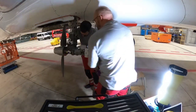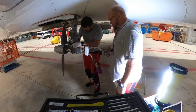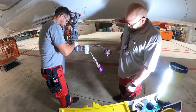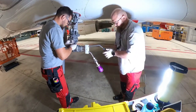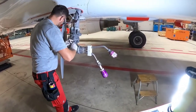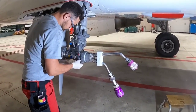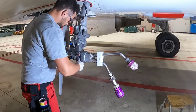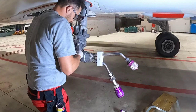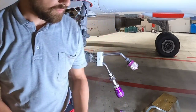Now, what's the purpose of the RAT? In an emergency, the hydraulic pump of the RAT supplies the blue hydraulic system. Electrical power can also be supplied through the blue auxiliary system by the constant speed motor generator. The really interesting fact is that the system supplies hydraulic power in less than 4.5 seconds from the time it gets the electrical command to extend. The automatic function only operates when the speed of the aircraft is more than 100 knots. Hydraulic power available from the RAT is sufficient to supply flight controls and the generator.